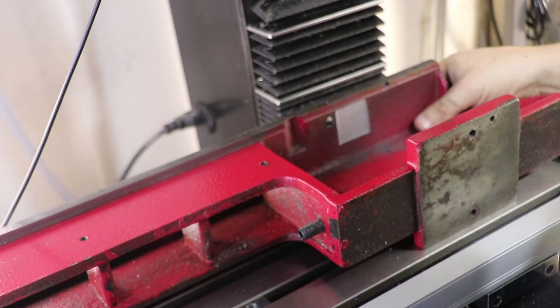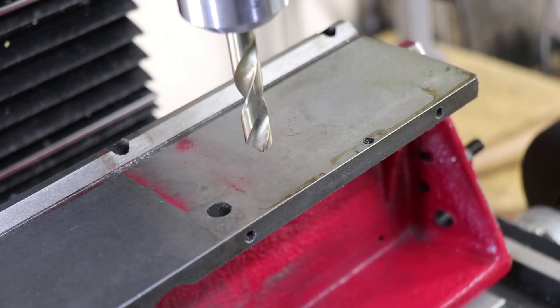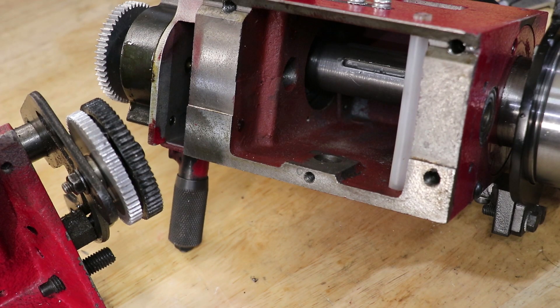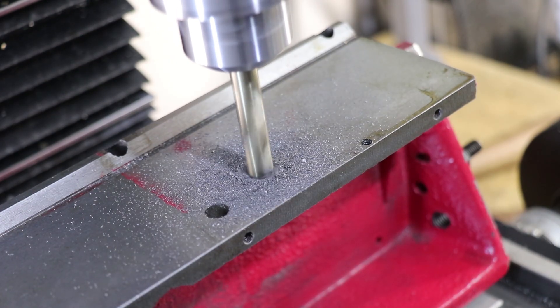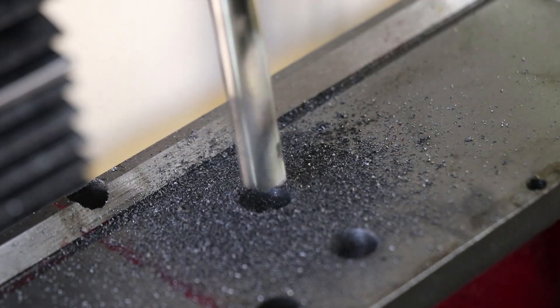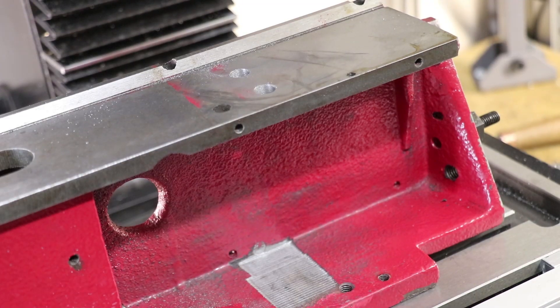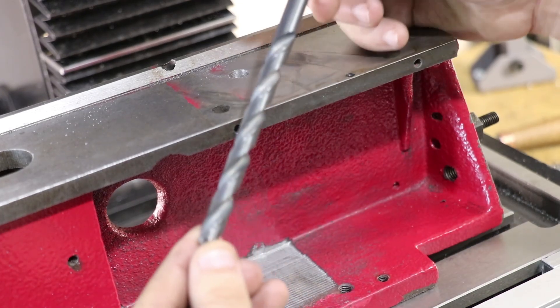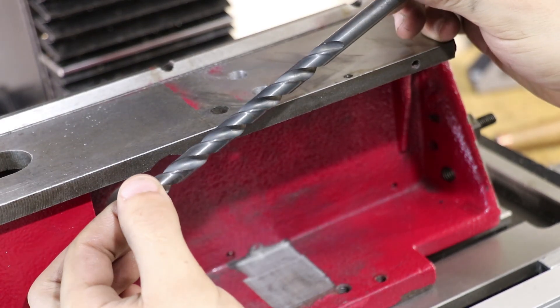I ended up machining both sides, top and bottom, and I did machine it a little bit deeper off camera, but it's a pretty straightforward operation. Next I'll drill the holes for the locking bolts. Thankfully the bottom of the headstock is open, so the placement of the holes isn't too critical. An issue I ran into is that the top and bottom surfaces don't exactly share reference surfaces — a lot of surfaces are left unmachined and have tapers on them. Thankfully I had an extra long drill bit in storage; this one is just slightly undersized so it should work, and I have no idea why I had it, but it's pretty convenient.